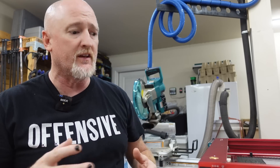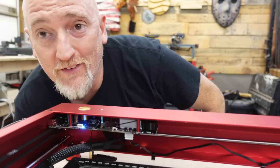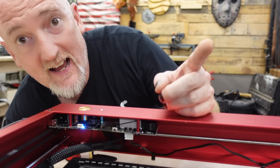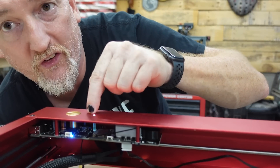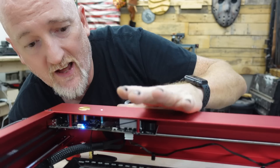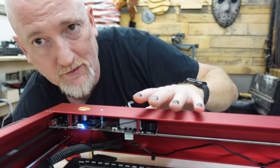Let's talk safety. This new unit has a flame alarm on it — if fire lasts for more than three seconds, it will shut the laser down. And it has a collision sensor, so if the machine hits something or something bumps it or raises it, it'll shut it down as well. They've also done something that some people probably aren't going to like: instead of starting it from your computer, you're going to have to physically come and press this button if you're using their software to start the laser. That's just another safety precaution to make sure people are actually in the room with their lasers.